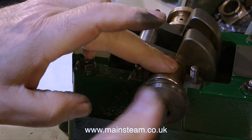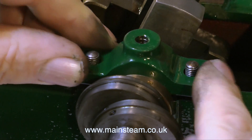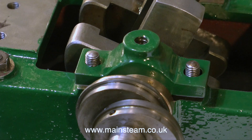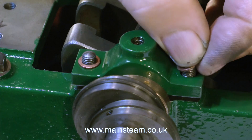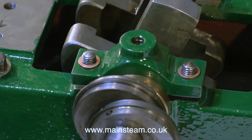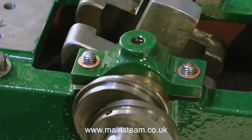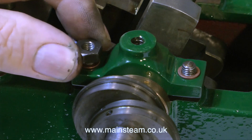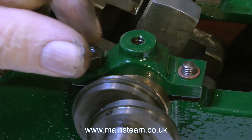I'm pleased to announce that these feel good and don't need any adjustment. I'm refitting the top cap - this is the one that was broken - and now that it's been painted, there's only you and me that know about this. We will see when I tighten the top cap down whether the joint cracks; I don't think it's going to. I'm fitting a couple of copper washers - I use them all the time on steam fittings - and this will protect the paint from the nuts.